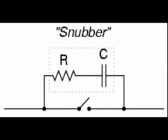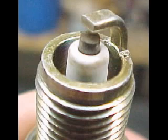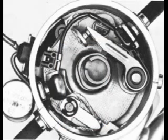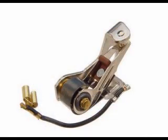Both AC and DC contact arcing can be minimized with the addition of a snubber circuit — a capacitor and resistor wired in series, placed in parallel with the contact. A sudden rise in voltage across the switch contact caused by the contact opening will be tempered by the capacitor's charging action. The use of snubbers in DC circuits is nothing new; automobile manufacturers have been doing this for years in engine ignition systems, minimizing the arcing across the switch contact points in the distributor with a small capacitor called a condenser. The service life of the distributor's points is directly related to how well the condenser is functioning.